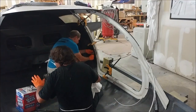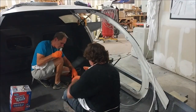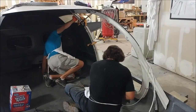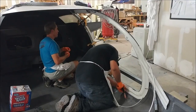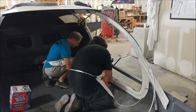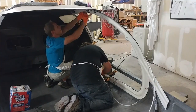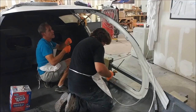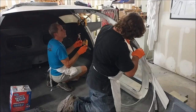On top of that we'll have the lines for the brakes, the static line for the pitot static system going through one of the conduits, and the electrical wires that run back to the engine — an ethernet cable that runs back to where the ECU is, and power cables running back to the starter and the fuel pump. We'll also have wires running back there for the lights in the wings. All of that stuff is going to be neatly put in conduits running in the keel. The advantage is we don't have to worry about anything rubbing or moving around, and none of those wires will be exposed in the cabin — you won't see anything like that.